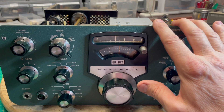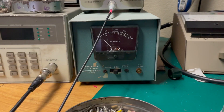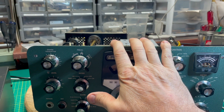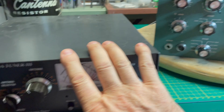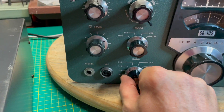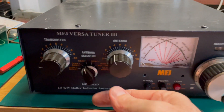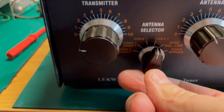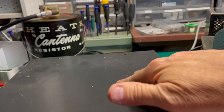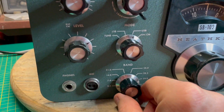I'm going to be using an antenna tuner and a dummy load. This is a Cantenna dummy load; there are others. This one is a dedicated dummy load with an RF output meter, which is handy. First thing to remember: when you have an antenna that needs to be tuned and a rig that needs to be tuned, you always tune the rig first, the antenna second. I've got my dummy load connected, going direct — bypassing the inductor and all that other stuff — straight into the dummy load. We're going to do 80 meters first.